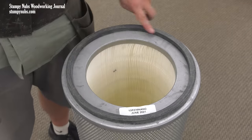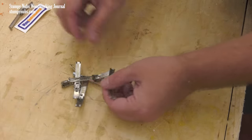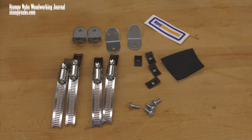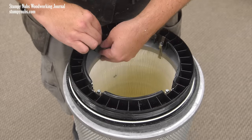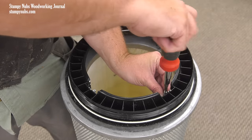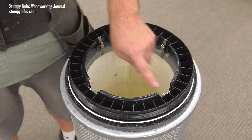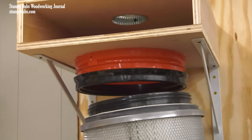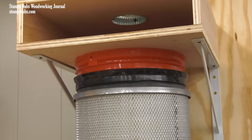The remains of the lid fit nicely on the gasket of the flangeless filter. To secure it there, we'll use what are called FGL6 latches. Wynn supplies these with both of the filters I showed you earlier, and they also sell them on their website. They're smaller versions of the larger latches used in a different video to mount a filter to our larger dust collector. One end of the latch hooks on the inner rim of the filter, and the other end hooks on the rib in the notch at the end of one of those cross members. Now you see why we needed a true gamma seal lid with two cross members — this gives us four notches for the four latches. Don't over tighten them; you don't want to deform your plastic rim. Now the filter will screw on and off your box, making it easier to clean. In fact, you could take it outside the shop and blow it out with a leaf blower if you wanted to.